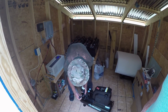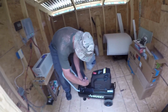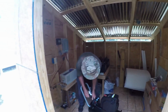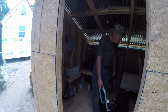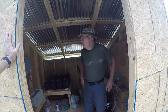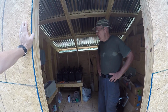So those 8 batteries over there, that could power a lot. It can. You can run a small air conditioner, like for the whole night. Yeah, you could run that all night. I have run it all night, and it barely even touches the batteries because it doesn't run all night. You know, it cycles on and off. The compressor, yeah, so it'll drop the voltage of the battery bank by a volt and a half overnight.